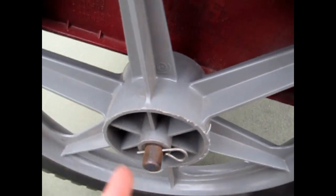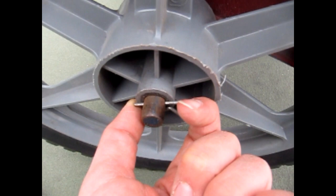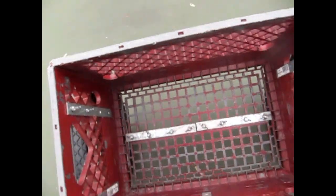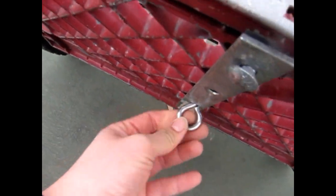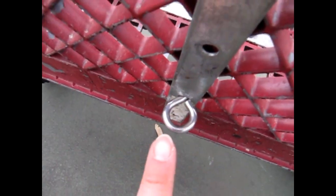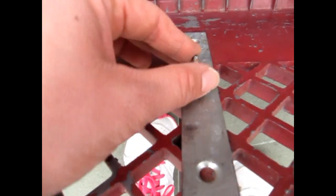This is very easy to take off and completely disassemble for travel. Going back to the axle, another method is to have a screw or eyelet welded onto the axle — instead of using a hairpin, you put the wheel on and wing nut it in place. That's another approach. These ideas are also similar to how I've done the attachment for the harness or spreader bar. I just had a plate here — if you're using wood you can drill directly into the wood — and on the other side you have an eyelet, very easy to take apart.